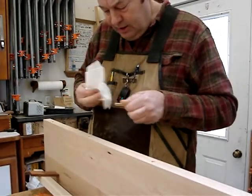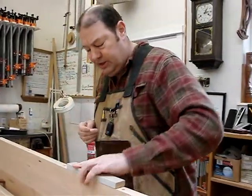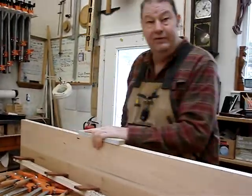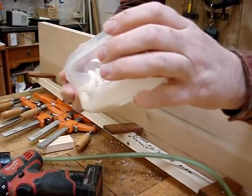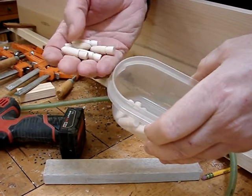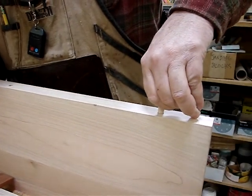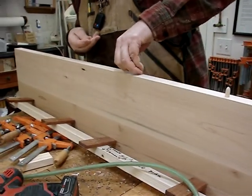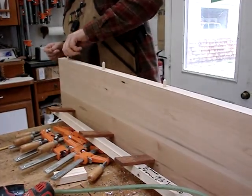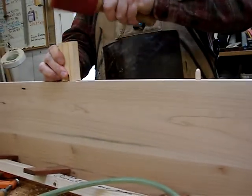I try not to get glue up on the surface. That takes care of spreading the glue — we'll give it another quick sand, and I'm not worried about sawdust. A little bit of fine sawdust down in there works like wood flour, like you would with epoxy — it doesn't hurt the glue joint at all. The pins are three-eighths bullet pins, and I got them from Amazon. There's a little groove on them so that as we push them down in, any glue that comes up gets trapped in that groove and it makes for a nice neat hole. We just push them in to start with — it's funny how some are tighter than others. I made a little block of wood with a notch in it that controls so I don't pound the pin in too far. That sets them all right at the seam depth.